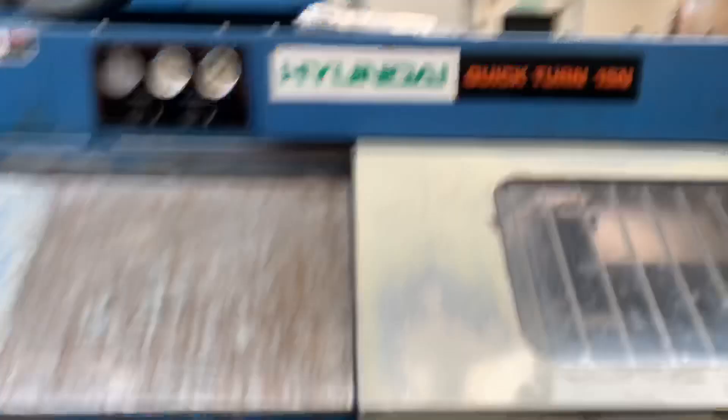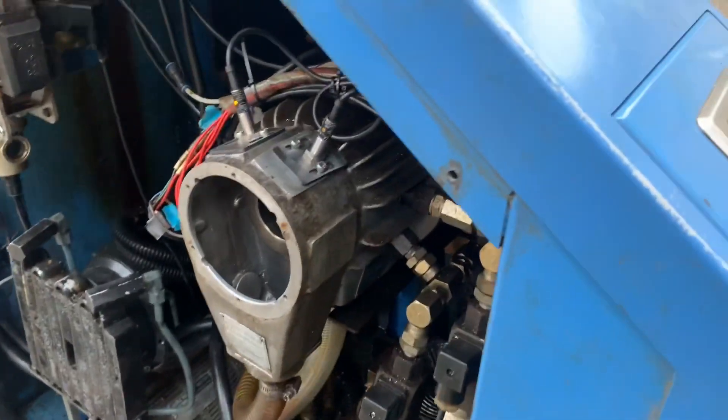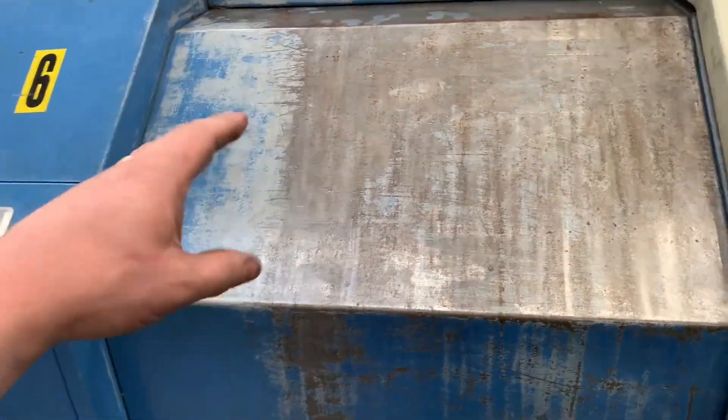If you're doing these manually you're just not going to be able to leave the machine, whereas if you're able to do them like this, I can put on a 12-inch piece of bar, run 20 parts, and go away for 20 minutes. And if I run a one-meter length in the spindle with spindle tubes to stop the bar rattling around inside, then we can run it for probably an hour, unless there's any errors. Just thought I'd show you that.